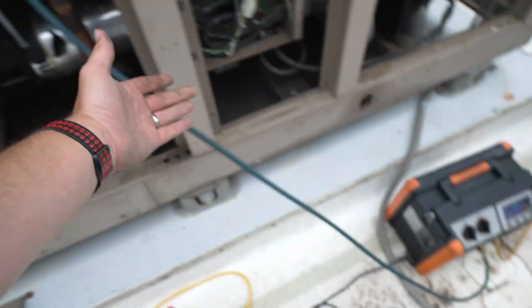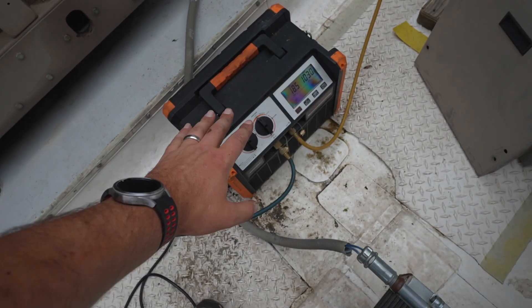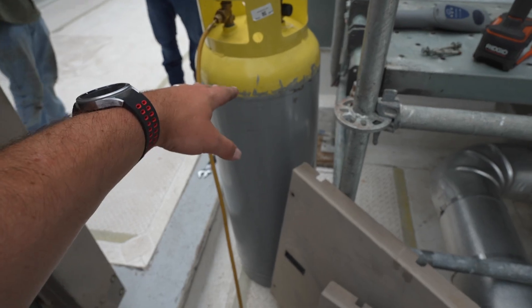There's been a lot of conversation and questions around using push-pull procedures — how we want to do it, what's a good time to use it, when not to, and what the alternative is. The thing we're most used to would be just a regular pull, which is what I'm doing now. We're coming straight out of the liquid line, doing a recovery, going through our machine and into our cylinder.